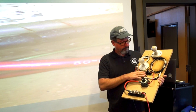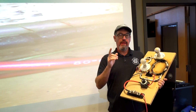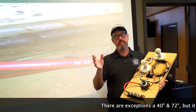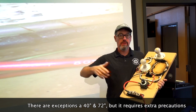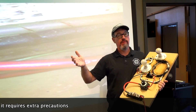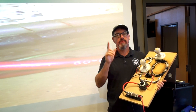When installing something new, make sure it always has OCP. ABYC says you're supposed to have OCP within seven inches of a battery or source of power — battery switches, distribution bars, and so on. If you see conductors leaving these sources of power without any circuit protection, it's your job to figure out why and get it in there and make it safe. That's the tech tip — thanks for watching.